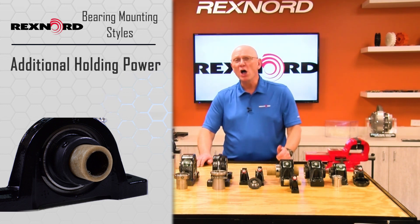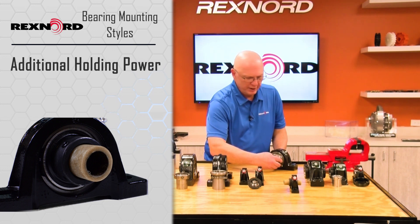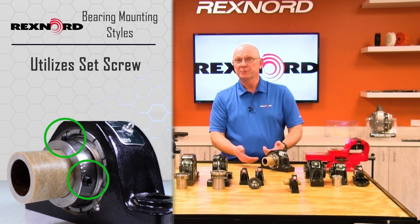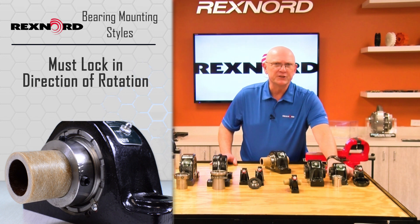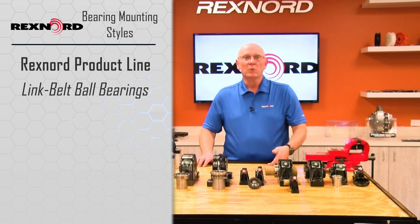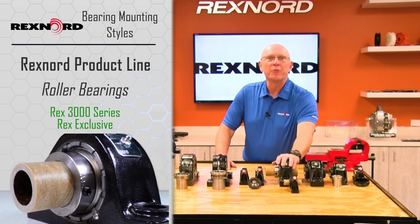The reason is I get a little bit more grip force, and they're also a little bit more tolerant to shaft size. The way they work is I've got a collar that's got a cam on it and an inner ring that's got a cam. The collar goes over the shaft, over the inner ring, and I rotate till it's tight. That gives me a tremendous amount of grip force with the collar onto the shaft. Its limitations are that it still has a set screw, which causes burrs and makes it difficult to get off the shaft. Also, you must make sure you rotate this in the direction of rotation — if you don't, there's a chance that it will come loose. Within the Rexnord product line in ball bearing, we have the Y inner ring, wide inner ring, or the W narrow. In our heavy duty ball bearing, we also have a Y inner ring. And in the Rexnord Rex product line only, we have the 3000 series bearing.